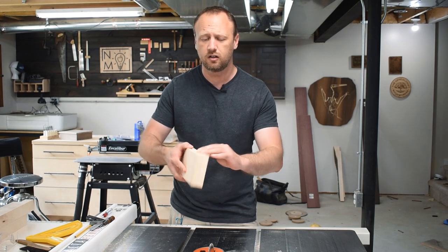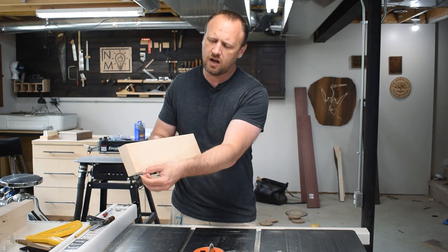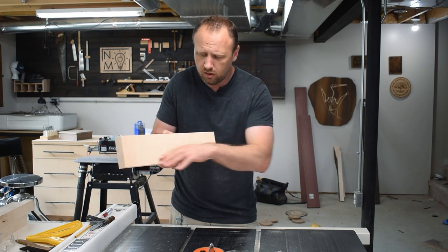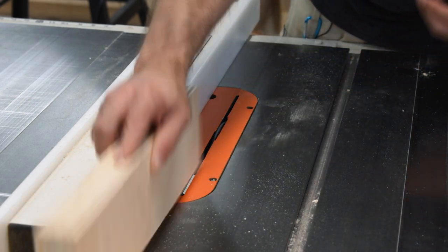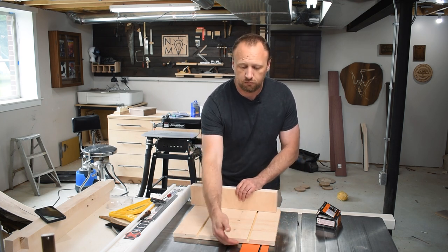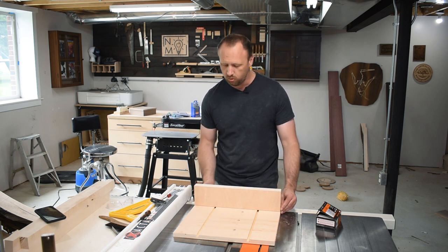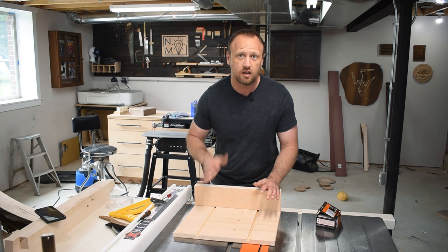The fence is dry and I've cleaned up all the sides on the table saw. Before attaching it, I'm cutting a tiny shallow notch on the inside face — a relief for sawdust, so buildup in that corner doesn't throw off my cuts. To attach the fence, I line it up with the back edge since we confirmed the front edge is at 90 degrees to the blade. I drill countersunk holes from underneath and screw the fence into place, then do a test cut.